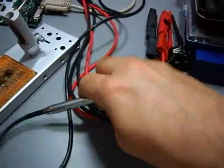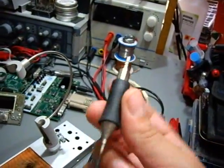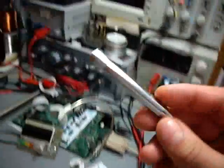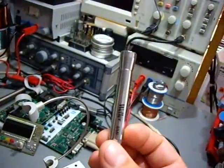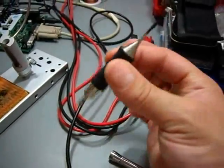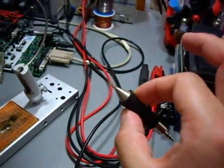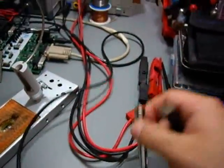To replace the tip, you can just pull it off. It looks like this. The funny thing about it is you can do this while the station is switched on. So changing the tip is a matter of seconds, and you can grab it even if it is hot, because this is the whole module you can replace, and not the tip itself.